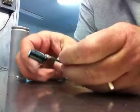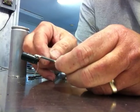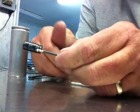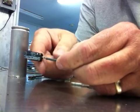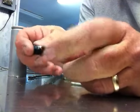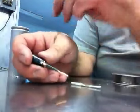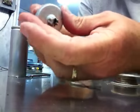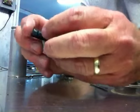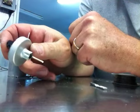What I've done here is take a brand new electrolytic. I take the positive lead, wrap it around a piece of 14-gauge wire — you can use 12-gauge too, this is just a piece of 14 I had. Wrap it around, give it a good solder joint, and pull it over to the side so it's away from the negative lead and can't hit it. Strip the other end so that when you slide it all the way down and it hits the rubber at the bottom, you've got enough conductor coming out to put your connector back on.